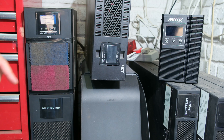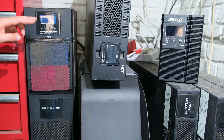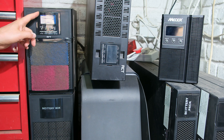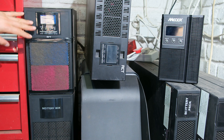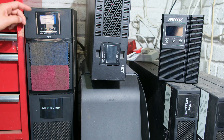So what is the problem? You buy the UPS and it normally has a very good backup time. For example, this UPS used to give nine hours of backup time with those three battery banks including the built-in bank. Nine hours. It now gives 45 seconds. This is not designed for peak usage. Even though it says 6kVA, it is not designed to even give you 5,000 watts. It's actually just designed for a dip in the power. For load shedding or outages, the more you allow this to feed your load during load shedding, the faster the batteries are going to decline in lifespan.